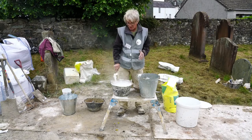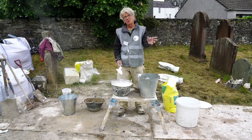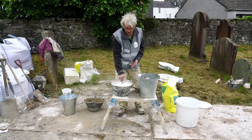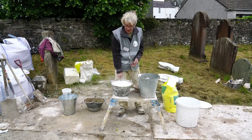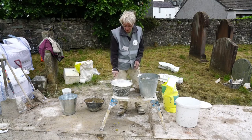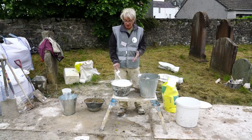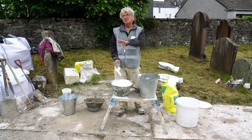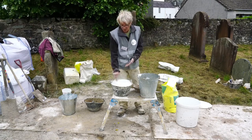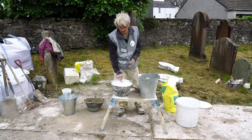And the chemist in the room will tell us that for every 10-degree rise in the temperature of the liquid, the reaction will double in speed, and you're seeing that it's reacting as soon as I put it in. So although I drowned lime in the beginning, I might be wrong, I feel that now that the temperature is reaching the right temperature, it's picking up that lime. And this is powder, of course, so the burning, chilling, or vice versa, drowning, can be overcome, I believe, and that's what we're seeing now. And so we now have quite a viscous material.